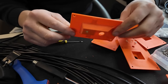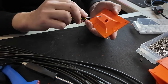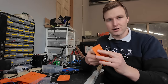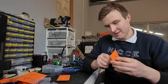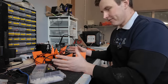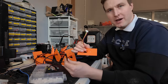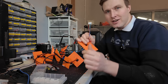Next up we add all of our little glands — our waterproof cable glands — into our casings. This is what takes the seven-core control cable into our little boxes. So now we have our pile of back printed parts ready. The next stage is to prepare the cables so that they are like this, with the little tiny connectors. This is a slow process, so I'm probably going to be at this for the next hour.